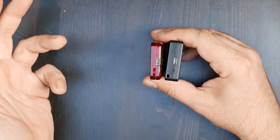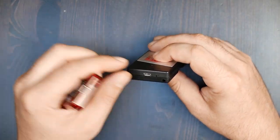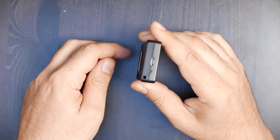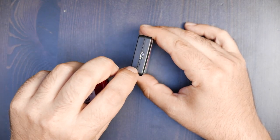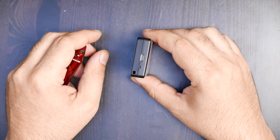reset hole. While you can use it to reset a PICkit when it misbehaves, I've always found it easier just to unplug it and plug it back if there are some issues. However, if you do vertical programming, you can also see LEDs through this hole. If you just angle it right, you are going to be able to see the side LED, which makes programming and seeing programming status much easier.